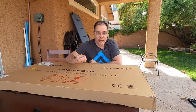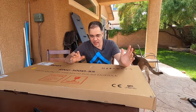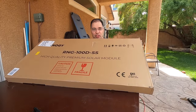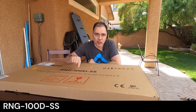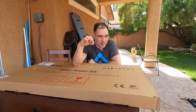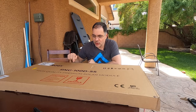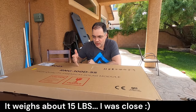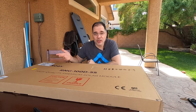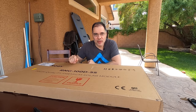Although that buck converter is great for using with any panel lying around, if you wanted a specific panel that's portable, you might look at one of these — a Renogy 100-watt panel. It puts out 20.4 volts on the low side, so the buck converter barely accepts it at its 20-volt minimum. This panel is only $89, has 22% efficiency, and weighs about 30 pounds, so you could tote it around, put it in your car, or mount it on top of a toy hauler or big rig cab and run the wires down to your buck converter.